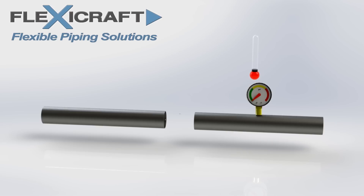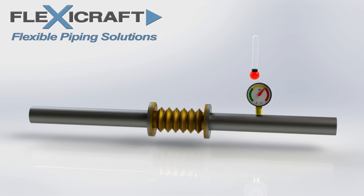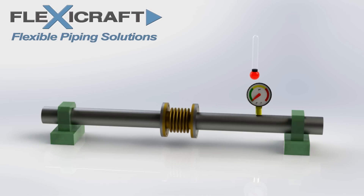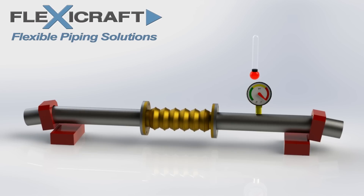But if we cut a hole in the same pipe and add an expansion joint, we have a model like the bendable straw. Now when we again pressurize the unanchored system, we can see the joint will stretch out to failure because it's not stiff like the pipe. When we add back the pipe anchors and again pressurize, the joint does not stretch out from the thrust load because the anchors are preventing that. But if the anchors are not designed to withstand the new load, they can fail and consequently allow the joint to stretch out and also fail.